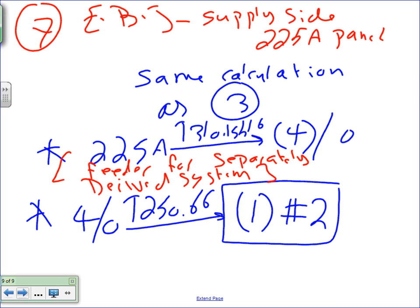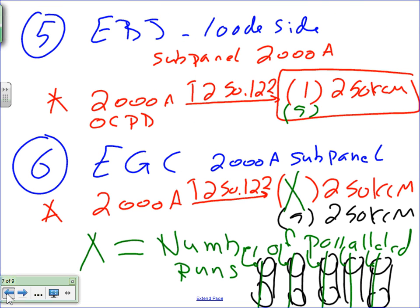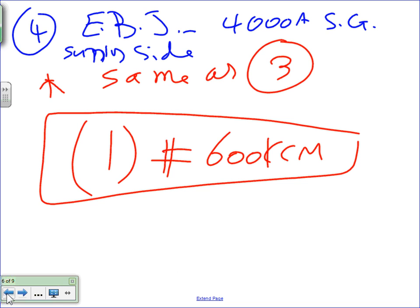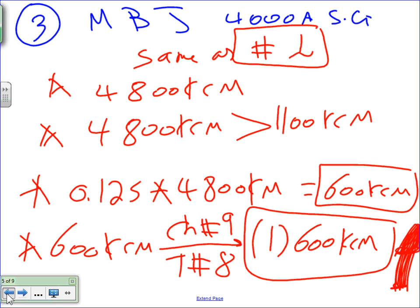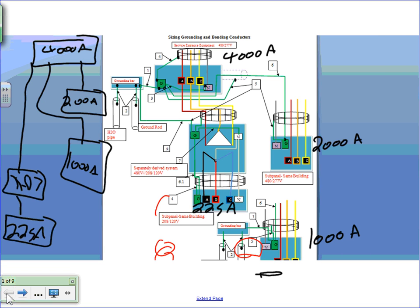That's from the conduit. If you look where it's located, tying the conduit, this is exactly like the system bonding jumper, and a system bonding jumper might actually erase it. If you look where it's located, go back, Chad, right here. Do you see that from the conduit, from the flex that's coming to the panel, into the panel itself? And 6.1 most likely will take care of it if you have the right bushing here. So that's right here.